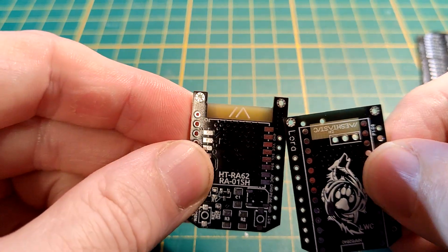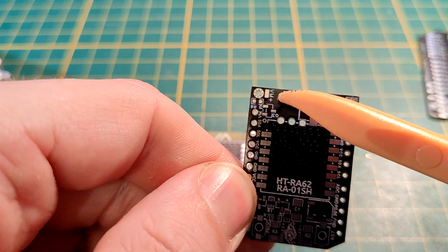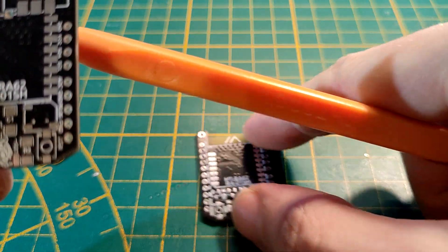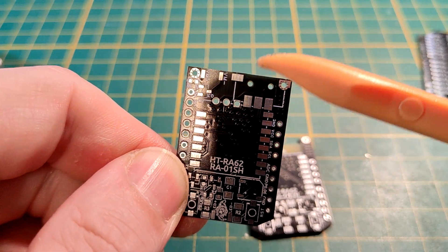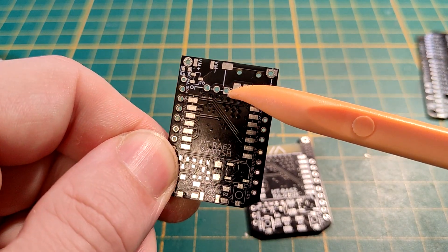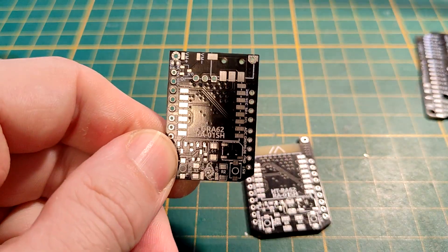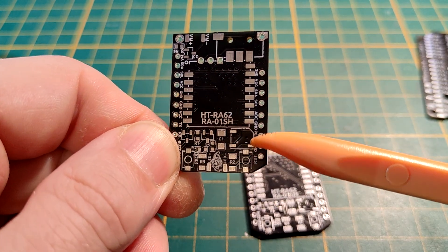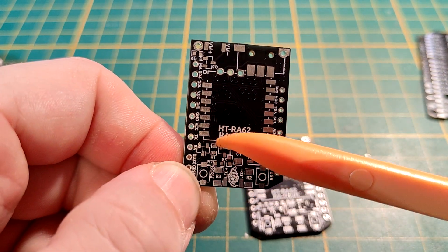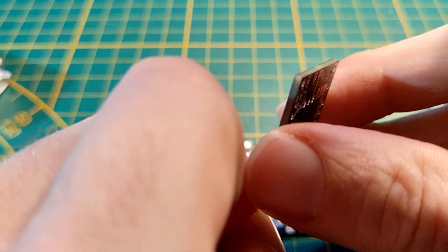As you can see, the cutout is gone and we are now using that space for an additional MOSFET with pulldown so we can control the vibramotor. You have nice exposed pins — plus and minus — where you connect the vibramotor. Also on this board, the three extra GPIO pins on the Pro Micro board were sitting right underneath the Bluetooth antenna and weren't being used, so they are broken out here as well so we can add an actual navigation switch directly on the board.